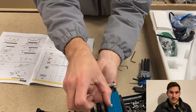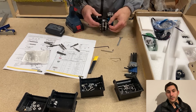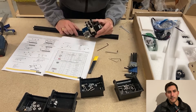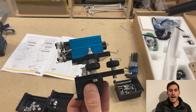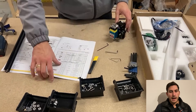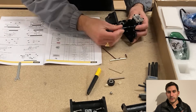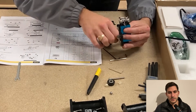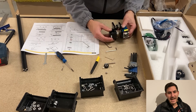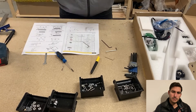Here is basically the first sub-assembly and also my first mistake. I was trying very carefully to follow the steps, partly checking whether it was going to be one of those 'oh it's Chinese and it doesn't work' situations. The first problem was the screws hitting the profile when I tried to slide it on. My solution was to disassemble and swap to low-profile button-head screws instead of the supplied ones — but later you'll see that wasn't actually required. That mistake was mine. Reassembling everything and testing it out, it worked fine.